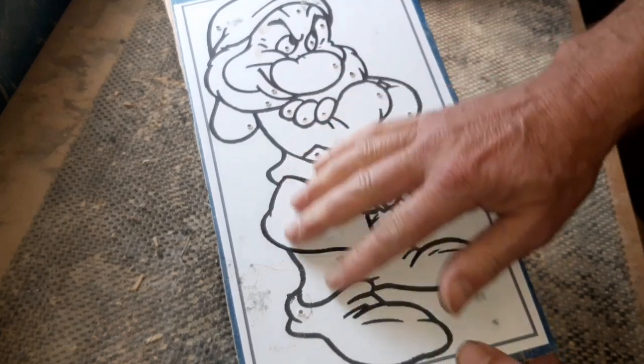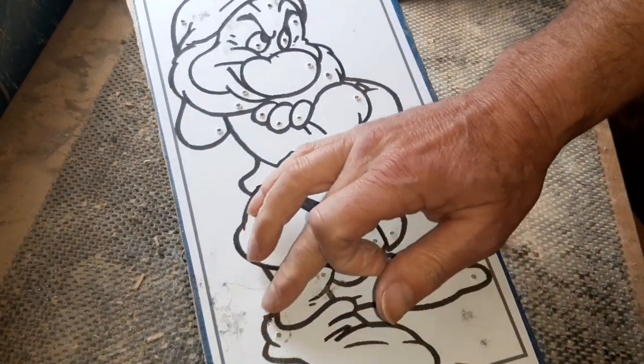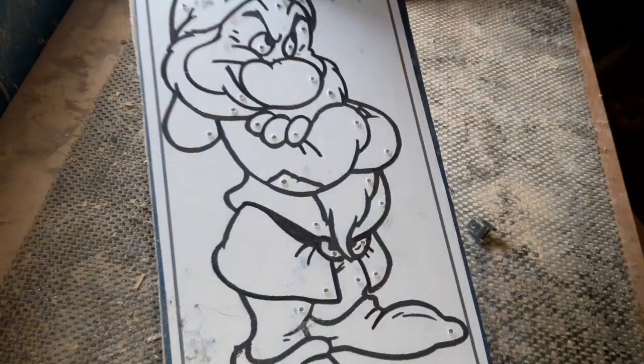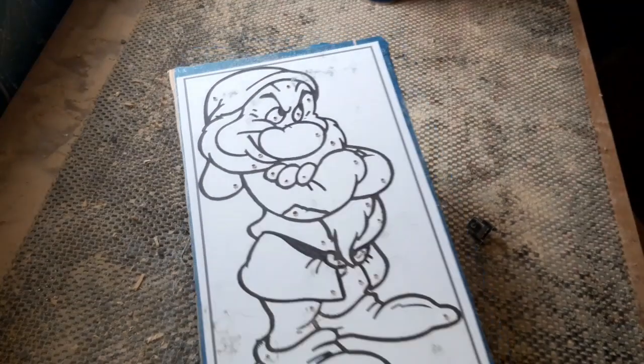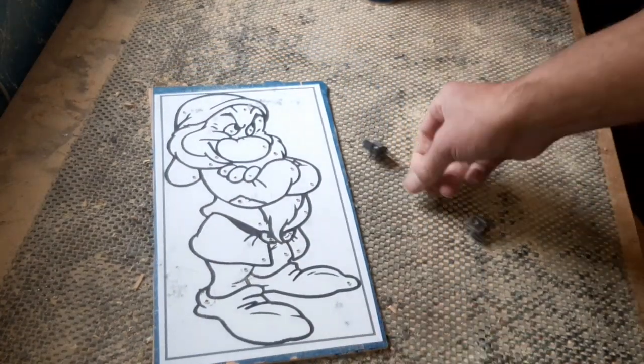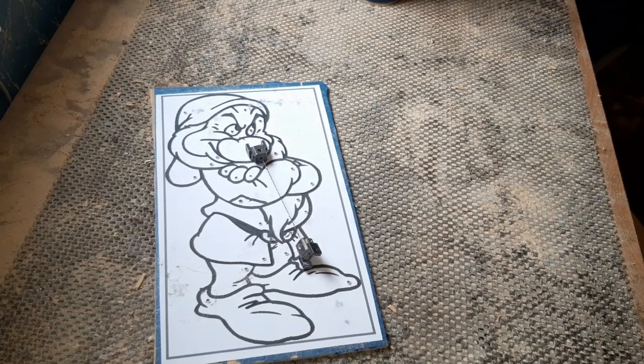And once we've cleared all the inner sections, we'll hold our breath and then basically go around the whole lot. So we're just left with the black lines. And like I say, we'll pop it on to a backer. Okay, let's pop this on the scroll saw. Pegas number 5 spiral blade for me. And we'll start cutting this one out.